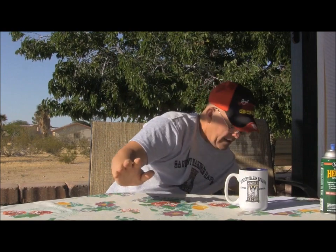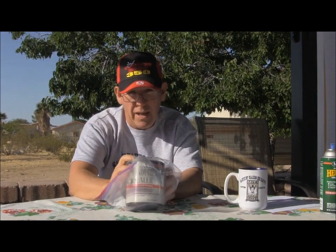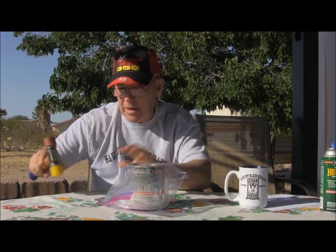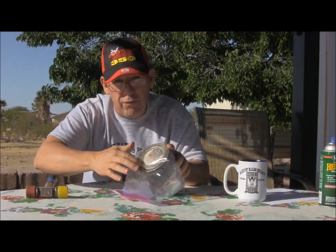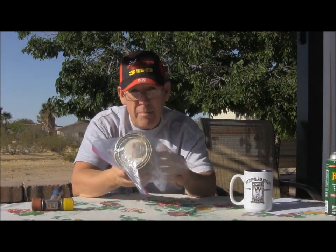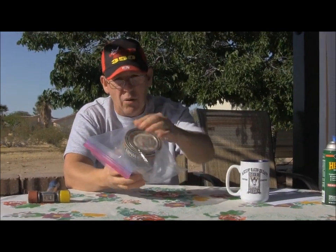That's from Kim Fields. So, my suggestion is, I don't have a quart of this spar urethane, so I just use my sanding sealer. This might be a way that you can, if you're having these things, definitely what you want to do is hammer this thing down. I'm not going to do it because this is a glass table underneath here, but make sure that you hammer down on that ring right there, and that will hopefully seal it up for you. But if you've got a quart can, this is just a gallon Ziploc bag, and there have been times where, if that doesn't do it, I'll even double bag it and have a double seal on it. But that may help if you're having problems with these quart cans kind of drying out, if you don't get that seal all the way down in there.